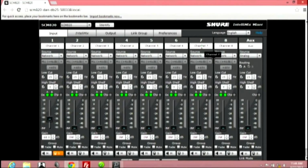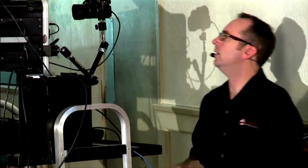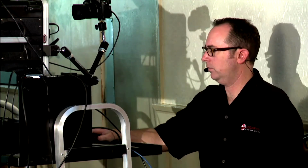Pretty much any web browser, I think, works with it. And while I'm doing this, I'm going to open up another tab and look at the sound devices. PIX 260. And I'm going to type in its IP address, 169.254.2.156. Oh, guest. And now I see not only my Pix, but I see Scott's as well.